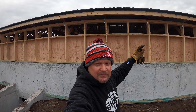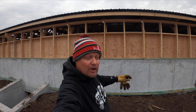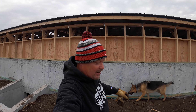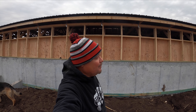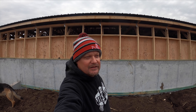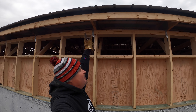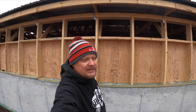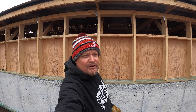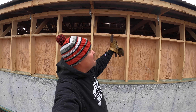This is a two-part roof — two sheets, not one continuous sheet. The top sheet closest to the peak does not have that membrane on it because it's quite a bit more expensive, but you also don't have the same moisture problems on the top side. This area right here is going to have bird wire on it so that air can go up into the attic, because in the cold part of the year when we're drawing air through the inlets, it all has to come from somewhere. On this side and the north side these soffits are open.